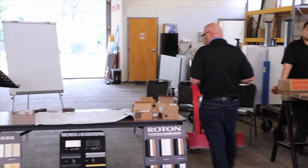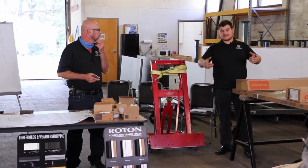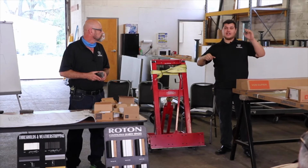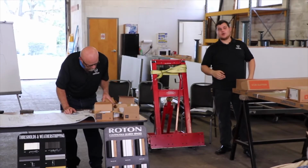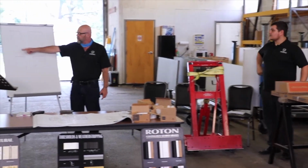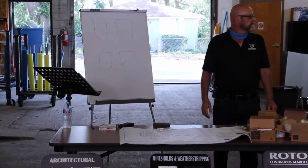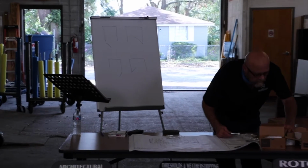And now the main reason we're going to see the NRPs is for exterior doors most of the time, because if I turn it in reverse, your hinge is going to be facing the outside of the building. If you have a door on the inside, like here with this door swinging out, your hinges are exposed. I thought that was a security violation. That's why I use NRP. Oh, okay, so that compensates for it.